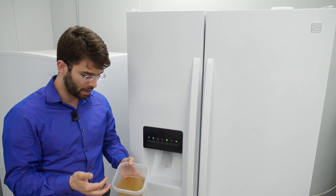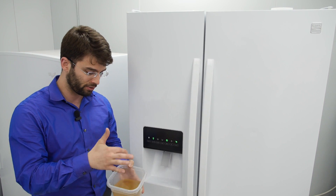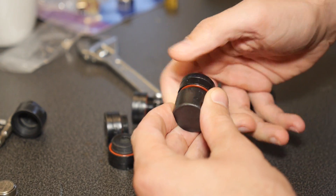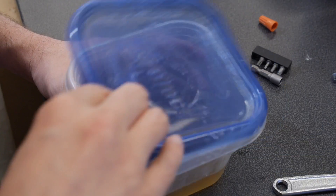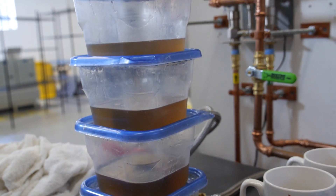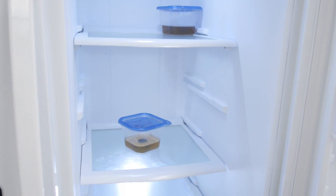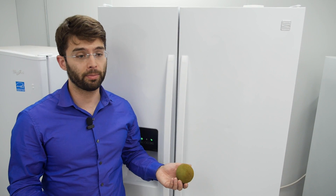We're using a food analog, which is a goo made out of methyl cellulose, water, and salt. We're using these little temperature loggers — this will sit inside the refrigerator inside that goo. We set these on missions to collect data every two minutes; once you set it up, it just sits there and keeps collecting. So number one is temperature.